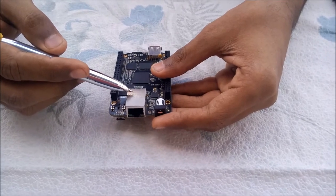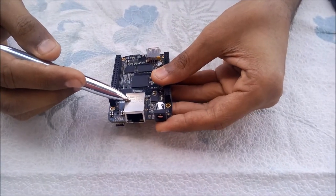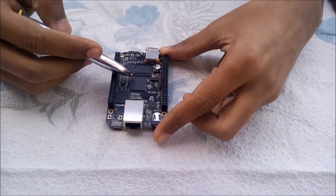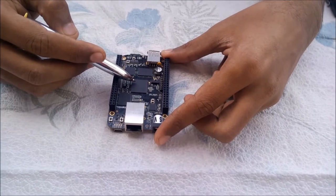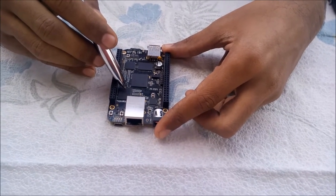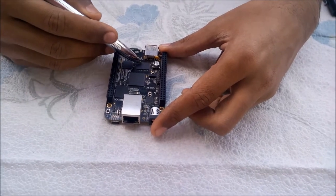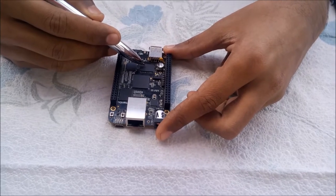The board uses the client USB port or the RJ45 Ethernet port as an option for SSH connection. The onboard integrated circuit runs on a 1 GHz TI SITARA AM335x Cortex-A8 ARM processor. It has 2 GB 8-bit eMMC flash storage and a micro SD card slot, and it comes with 512 MB DDR3 RAM which supports 1080p video encoding and decoding and an HDMI framer.